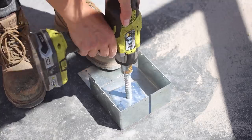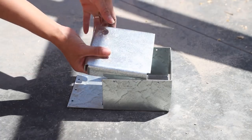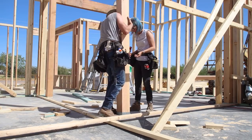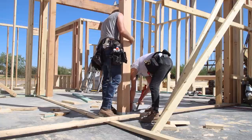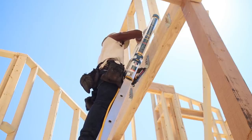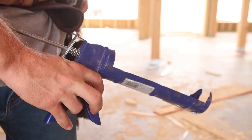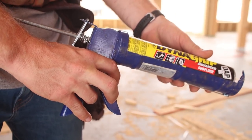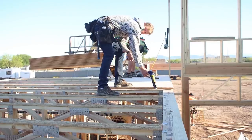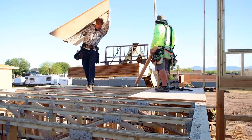We had a couple of spots in the entryway where we needed to install a few isolated posts. I attached the standoff post bases using more Titan HD screw anchors and then Bryce had to muscle the posts into place. We added some Simpson Strong-Tie truss hangers and prepared for the second floor. The second floor only extends over the kitchen and dining room, but that's a really important area and I wanted to make sure that there was zero squeaking. Bryce and a couple of the framers applied DAP Dynagrip subfloor adhesive to the tops of the floor joists before lowering one-and-one-eighth inch thick sheets of decking.